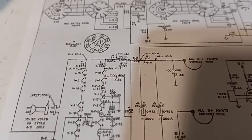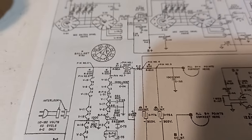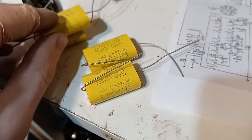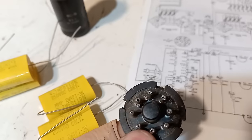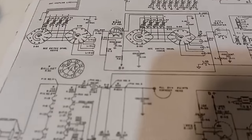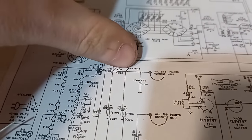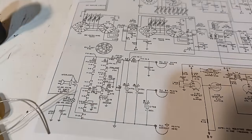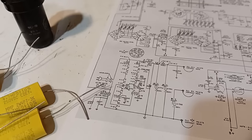There are two 105-ohm resistors inside the ballast. I read about a guy who replaced those with capacitors to make a capacitive dropper — he used two 10-microfarad capacitors. I have 4.7 microfarad caps, so I'll put two in parallel for each string and assemble them on here, just to power the setup with filament power to see that all the tubes light up. I won't have the B-plus section of the ballast installed, so no B-plus will get to the set. I'll also bypass the CRT filament since I don't have one installed, and run this on reduced line voltage.